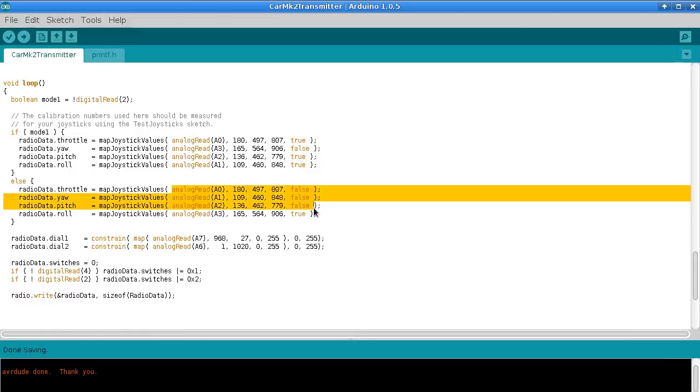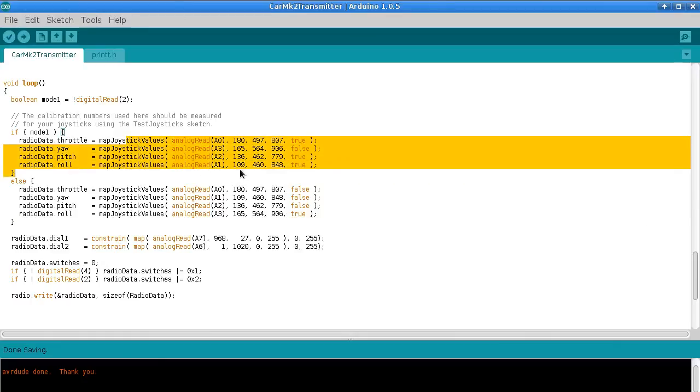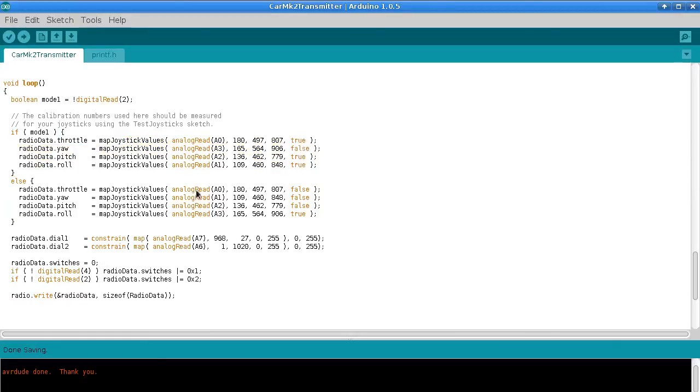This is how I have it set up for Mode 2. Now to make a Mode 1 situation — which is what I have up at the top — all you need to do is take the values you're using for yaw and the values you're using for roll and switch those over. Originally I was using yaw on pin 1; now I'm using yaw on pin 3. Make sure you take the whole section of that function and switch it completely.